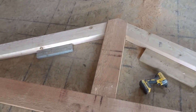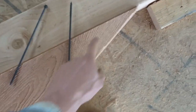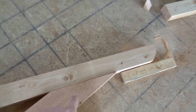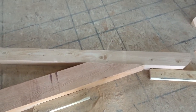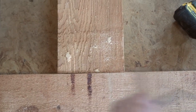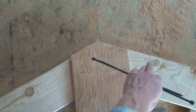I made my cuts at 5/12 on both sides. I found out it's a 67-degree angle. I put this four-by-eight up to the four-by-sixes, scribed the line, then duplicated it over to the other side. Then I found my center — seven feet from each side because this is 14 feet — squared it up, scribed the line, and got those cuts done.